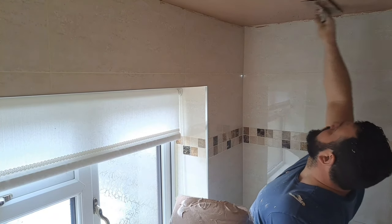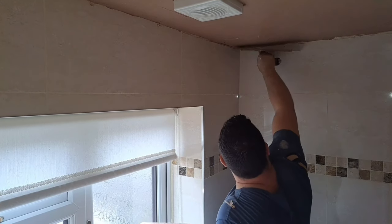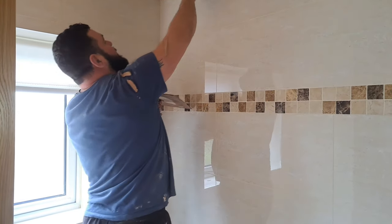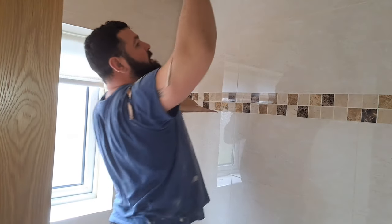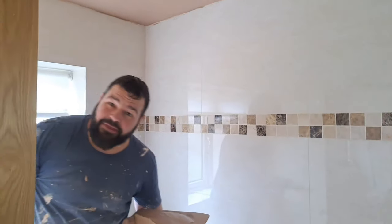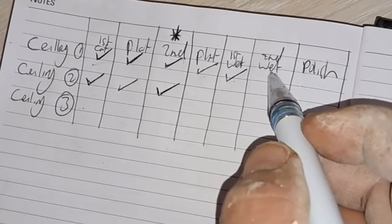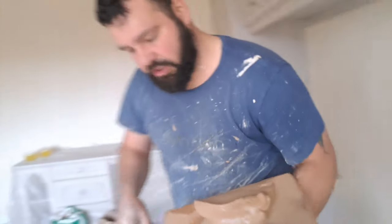Ceiling two is getting its second coat. Karen's got to go get another bag of finish from the truck - that's going to be six bags total, one man doing six bags in one go. These are only little ceilings so a rolling set isn't super necessary here - I'm just showing you the principle. Ceiling two has been second coated, we're at the star again, so we drop down and put ceiling three's first coat on. Then we come back in here to do ceiling one's second wet trowel.